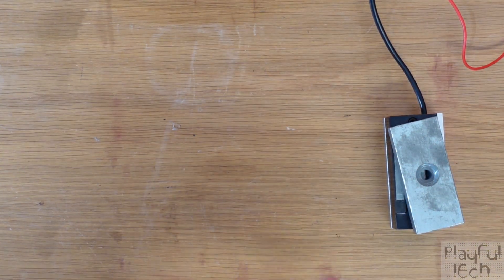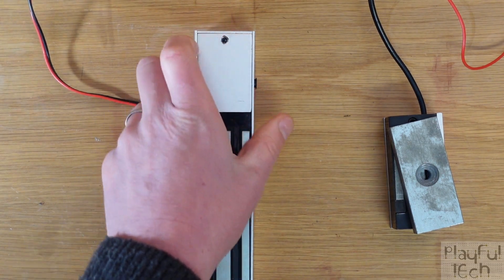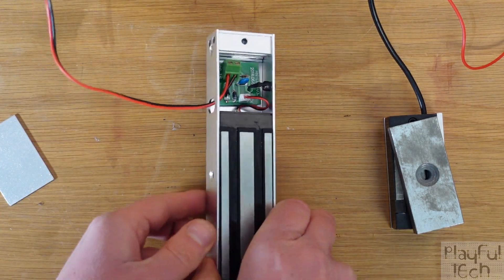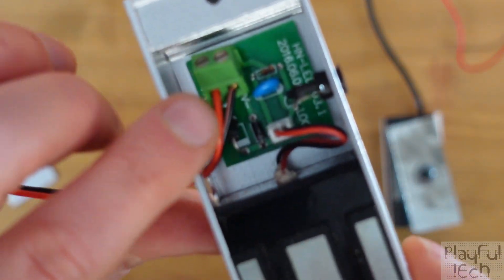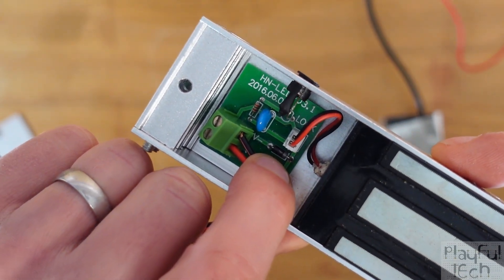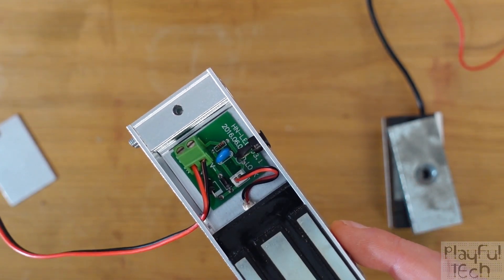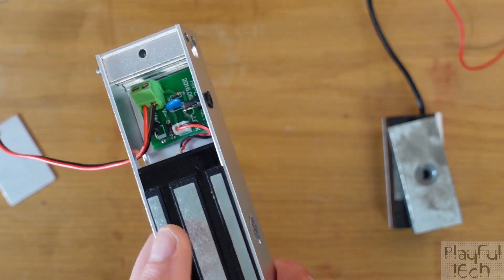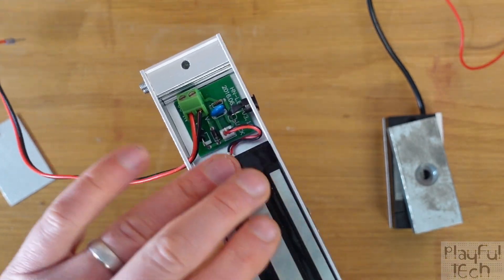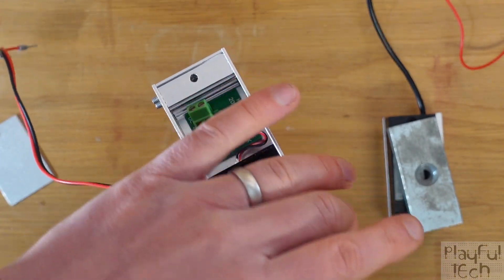If we go back and look at our full-size mag lock again, there's a little compartment at the end here, and if I just lift that up, you'll see that there's actually a little bit of extra circuitry contained in this mag lock. Crucially, one of the components shown here is a little diode — that is a flyback diode, and it's positioned across the windings of the coil, but in what's called a reverse bias. What this means is it has no effect at all when the mag lock is powered up, but when the power is removed, that diode will act to gradually dissipate any power that was stored in the mag lock and safely discharge that back EMF.